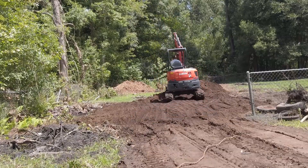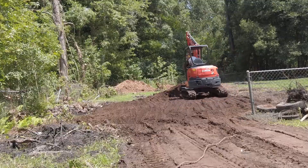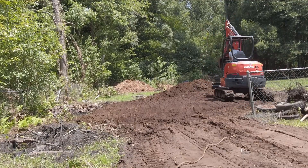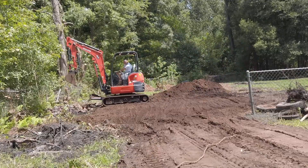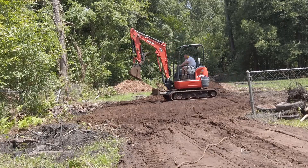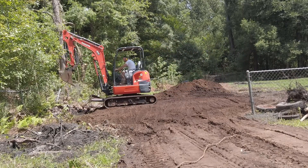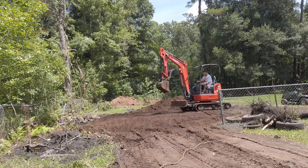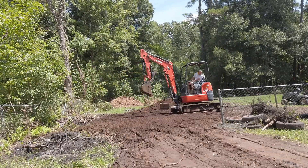Five hours, ladies and gentlemen, of that. It was actually quite fun using this machine for the time that I had it. Now, one thing you might notice - and I'm not sure if the camera can pick up on this - I didn't actually want this pad to be flat. I know that's not something you're used to hearing, because when you talk about installing pads you want them completely flat, and then on the edges outside of the building - probably about three to four feet outside of where the building is going - you want the pad to slope down. But in this instance, what I wanted was more of a gradual slope from the front right to the back left, mirroring the natural slope of the land.